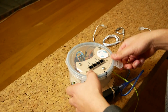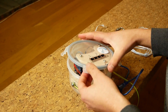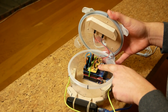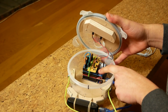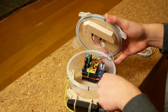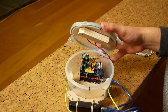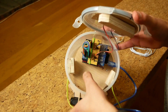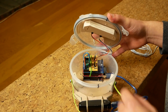Inside, these ports are connected to the Wheatstone bridges up here — we have 4 of them. I'm currently only using 2 but I can go up to 4. There are 2 HX711s on the inside, the data logger, and pretty much an upgraded version since I last showed you in part 3. It has some more room to make it tidier in the future and put some of these components in there.